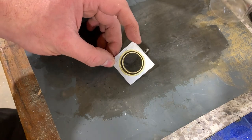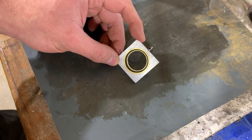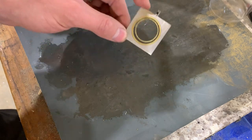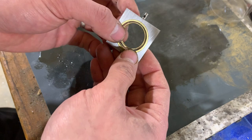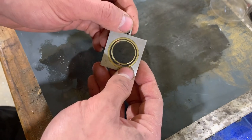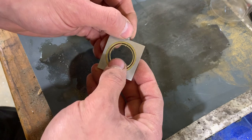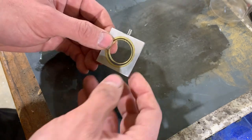So what we have here is a square of aluminium that I cut down from a piece of stock. I bored it out for a press fit for this brass ring. There's an inner brass tube here that can rotate, and it's held with this little stainless steel pin with a hole through it that goes on to the necklace itself. Should probably get it that way so the necklace can get easy. Anyway,